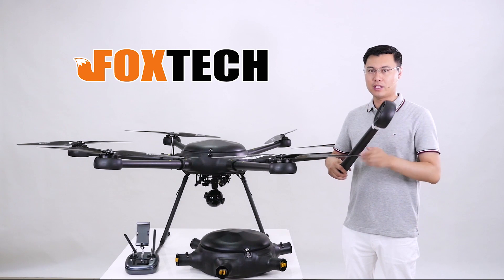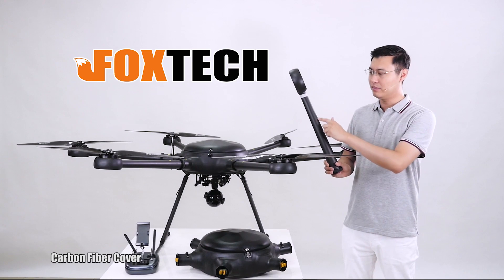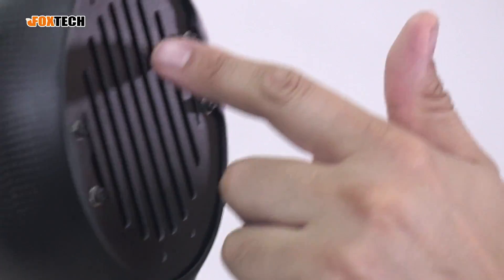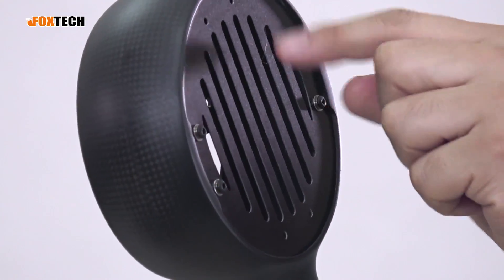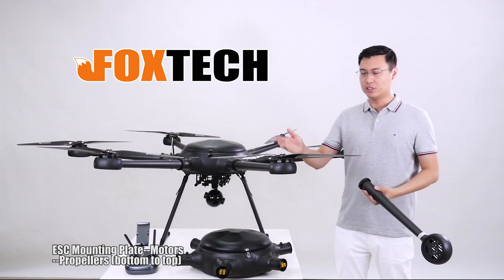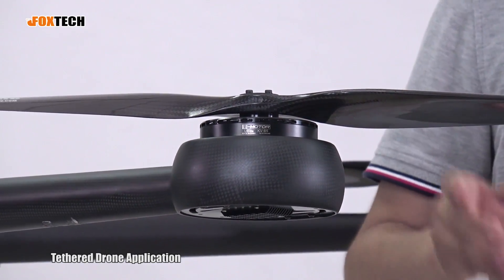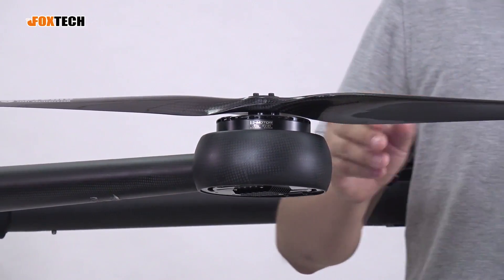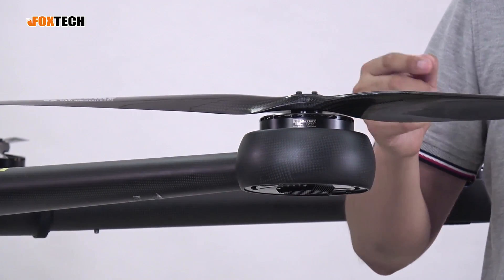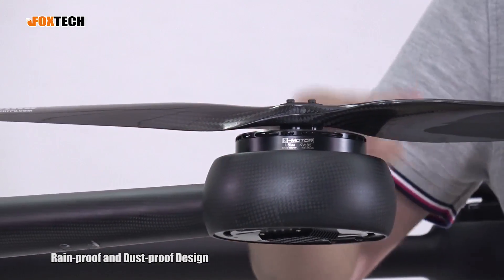The surface is purely very smooth with a matte black color. You can clearly see the carbon fiber patterns — it is very beautiful. On the bottom we also designed a mounting plate; the new version has a square ESC mounting plate. The motors are mounted on the top, designed for tethering purposes — top mounting provides enough cooling for very long duration in the air and also prevents rain or water from entering the arm.